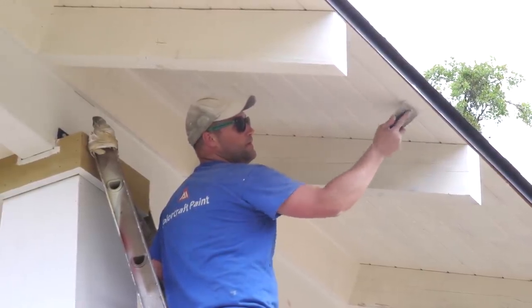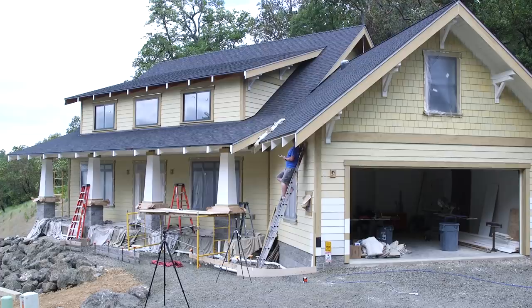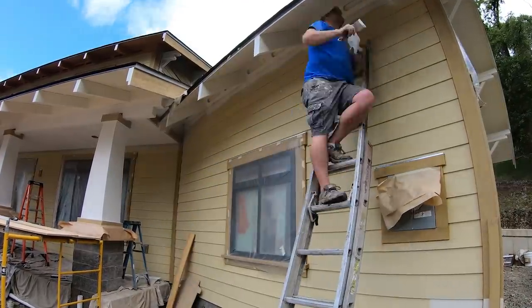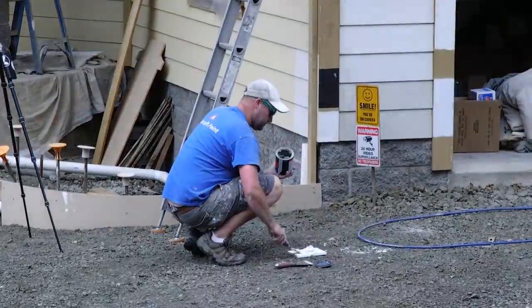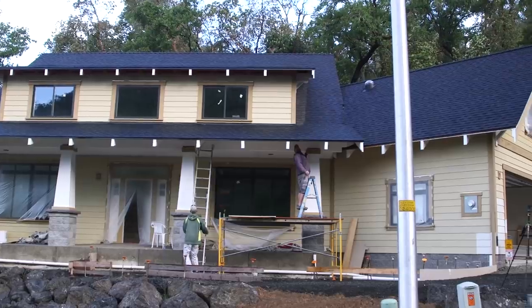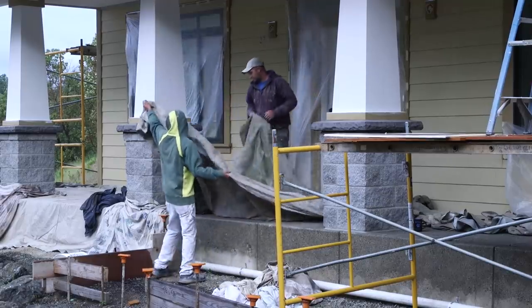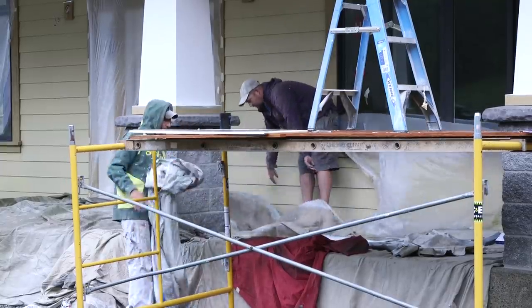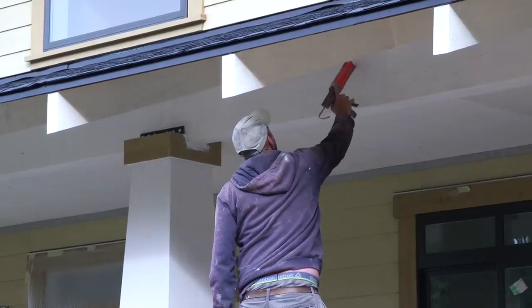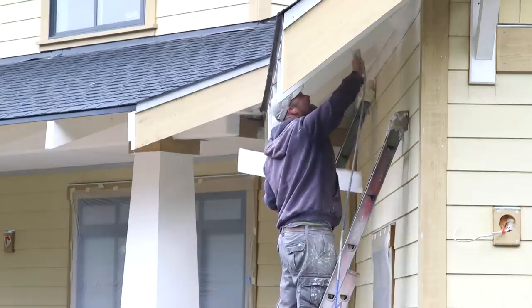I mean, there were knot holes and splits and the typical defects that happen in a board that is not intended to be interior finish work. And with the light color, anything that was a hole was going to be black. And so we had to spend some time with an oil-based exterior spackle filling the worst of those defects. Not all of them, but just enough.